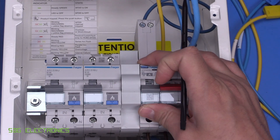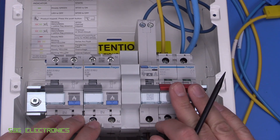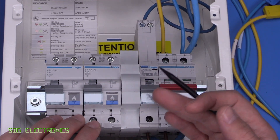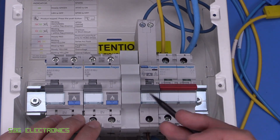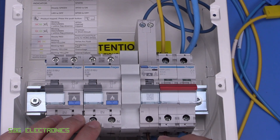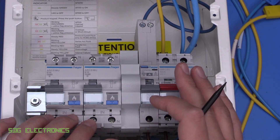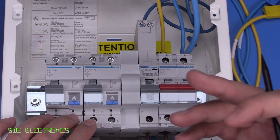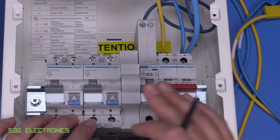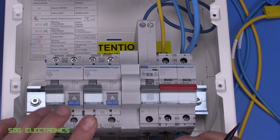The reason that they've added Bluetooth to this device is because arc fault detection is not without its difficulties. There are a lot of devices in the electrical environment — appliances, fixed equipment — that naturally produce a signature that looks like an arc fault. Things like brushed motors, welders, are all going to have some signature that looks a little bit like an arc because of how they function. Looking at various patents, these devices mostly look for some high frequency event with a particular signature away from the 50 Hz — so we're talking kilohertz, maybe even megahertz — and work out whether it matches a signature programmed into the microcontroller.